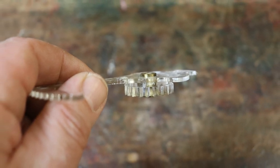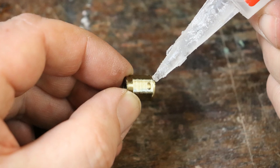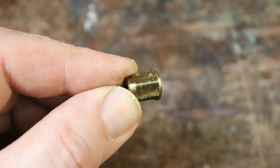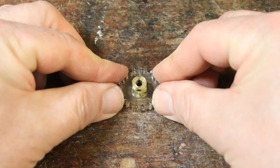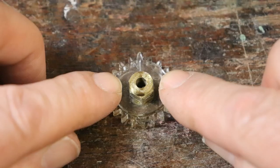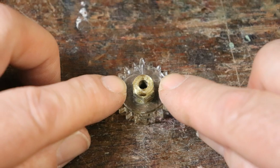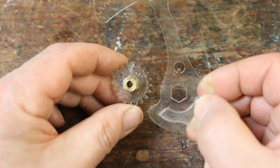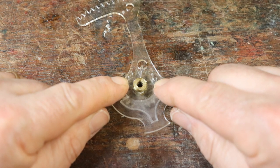Some joints may be quite tight. Once you're happy, take it apart and prepare to glue. Apply a drop of superglue on each of the spindle's hexagonal sides near the bottom to hold on the gear. Now push the gear firmly down onto the spindle so it sits against the flange. Put a few spots of superglue around the top of the gear and line the tooth on the spacer up with the engraved line on the gear, then push it into place. Finally, place a few spots of superglue on the toothed spacer and line up the rack arm so the tooth on the spacer lines up with the cut-out tooth shape in the rack arm. Then push it onto the spindle and hold it whilst the glue sets.